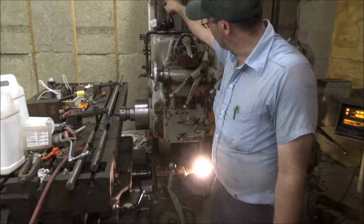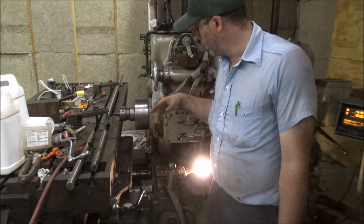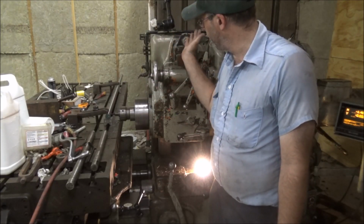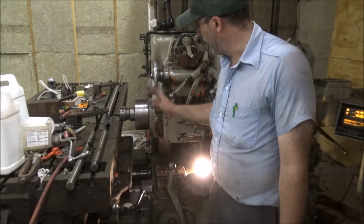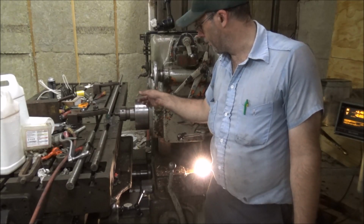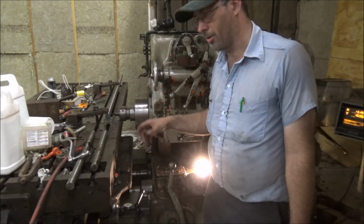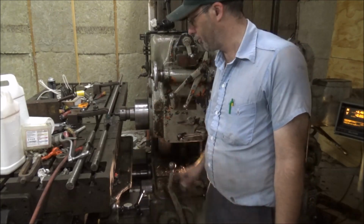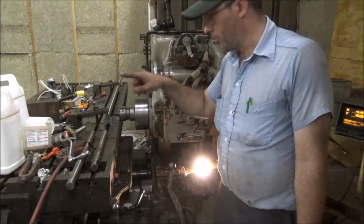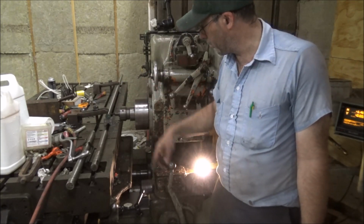And then I've got the indicator on the top, because this is a 3/8 end mill, but it's a 10 millimeter key, so I've got to widen it out. And I know I'm set to 0 and 15 over, and that gets me where I want to be on the key. This collet, or the holder, I gotta do some work on it. It's got enough run out that it's cutting oversized, so that's why I'm gonna take 15 to get 393 from 375. So let me move this out and move it down to the next one, and we'll get it cut, and hopefully I can get you where you can see it this time.